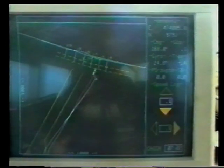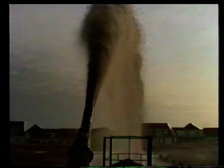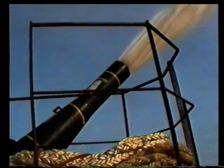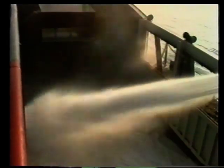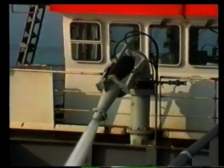The vessel's position on the beach is maintained by the autopilot, whilst the captain controls the velocity of the water shingle mix being discharged and the angle of the jet on the bow. The water cannon fires the shingle some 60 metres onto the beach. Remote-controlled water jets are used to disturb the shingle in the hopper and drive it to the suction inlets.